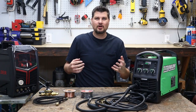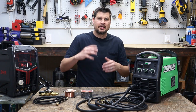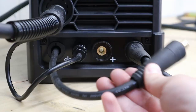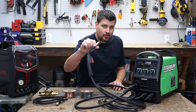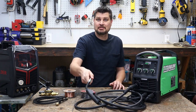If you've inherited one or just bought one off some classified ads and you're wondering if it has MIG capabilities, here are a couple things you can look for. Is there a gas inlet connection? Can you switch the polarity of your leads? That's because when you're flux core welding, your electrode needs to be negative, versus when you're MIG welding, it needs to be positive.